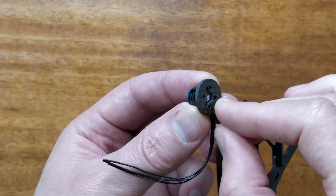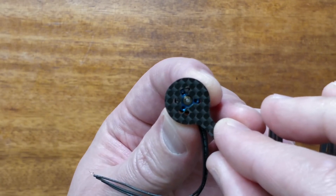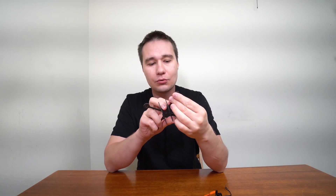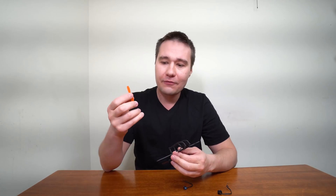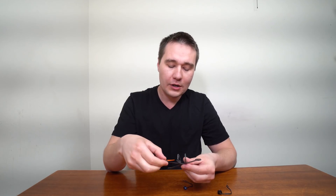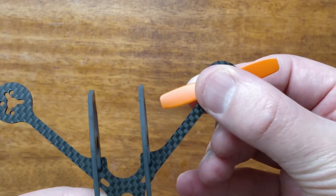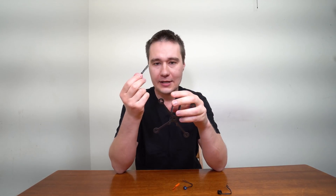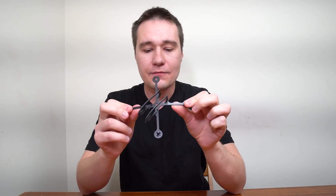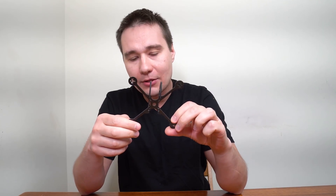It also supports motors like 0703, 0705, and whatever people come up with. It has a 3-hole mount implemented as cutouts going all the way up to 9mm M2, so you should be able to mount most motors here. We now have 2.5 inch propellers available, and 55mm and 60mm propellers for 1mm shaft motors, all working nicely with this frame. The 55mm has plenty of clearance, as does the 2.5 inch propeller. The new design uses an X layout, which lets me align carbon fibers really well along the arms.